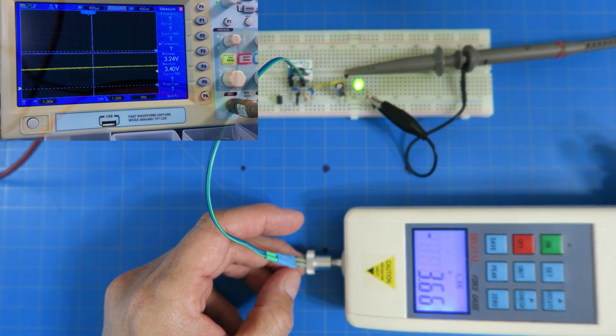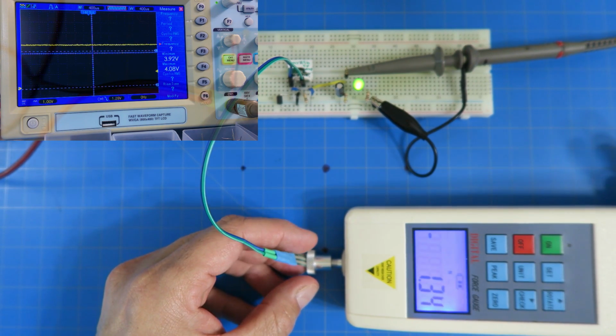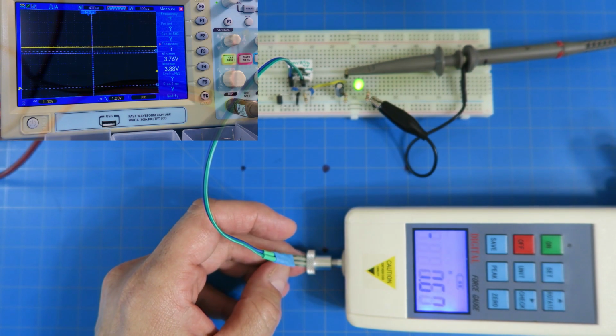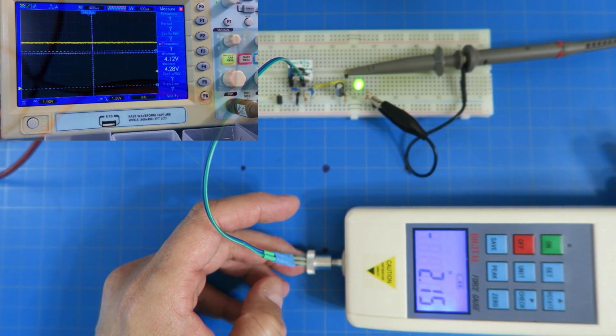So we would actually calibrate this and manually do this, create a table. Now I'm sitting here with my fingers on this doing it, but we would put actual loads on it, 1 newton, 2 newton, 3 newton, 4 newton, and you can actually get pre-made weights of an exact weight, and that way you could apply it here to create that curve, and then we know what our voltage is, and that's how we create our lookup table, and we can create our perfect scale.